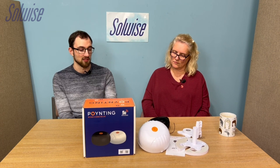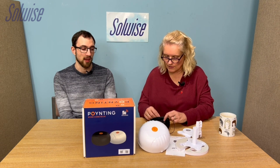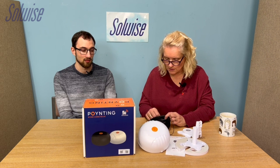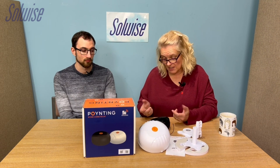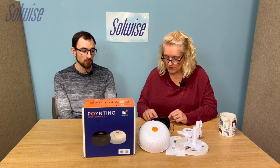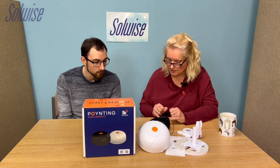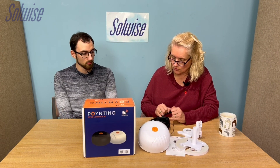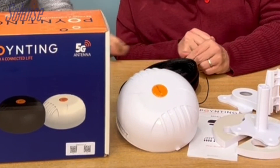The 7-in-1 is a slight upgrade on that — instead of just two mobile antennas, it's got four. The cables are colour-coded: the purple ones are for LTE — four of those — and two green ones for Wi-Fi. It says LTE on the side as well. The advantage of four over two mobile connections is that if you're using a proper 5G router or top-end 4G router, it's probably going to have four mobile connections, supporting four-by-four MIMO, which is double the performance of two-by-two MIMO.